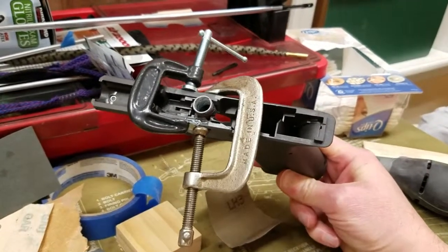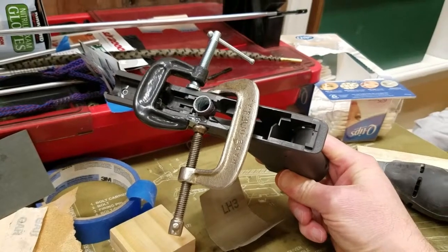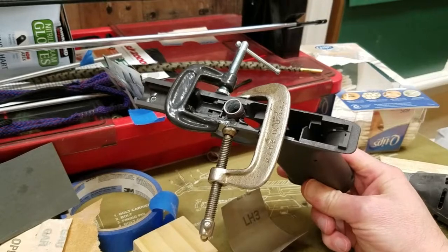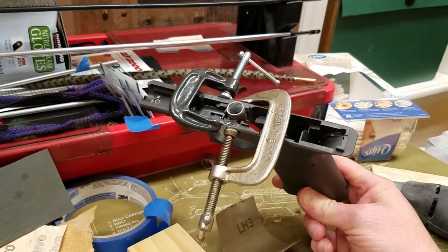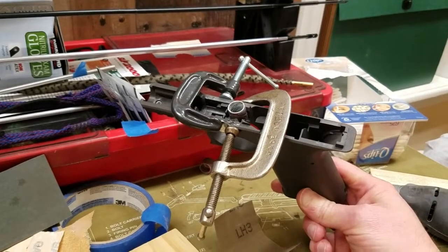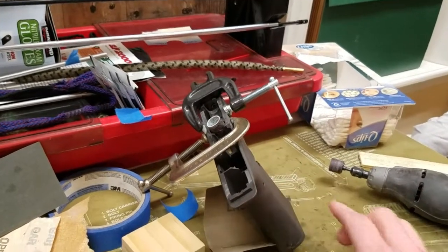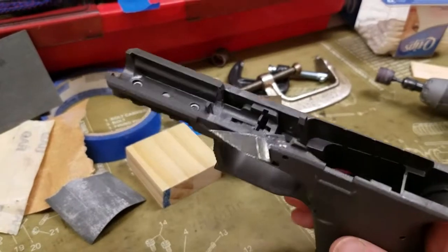Well, this is the first one because I'll show you how I kind of boogered it up in the mill. What I've got is some sheet metal formwork and a couple of areas that I used to retain some epoxy I got from Home Depot, just to see if I could fill in the dings made by the mill when I moved the frame in its jig relative to the moving blade or end mill. I'm going to go ahead and cut this off and then reposition the frame so you can see what it looks like underneath all that formwork.